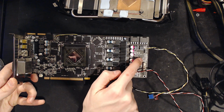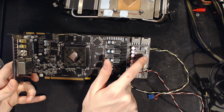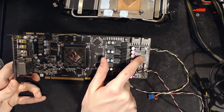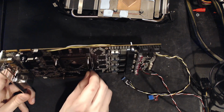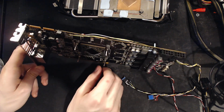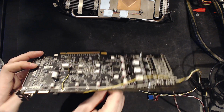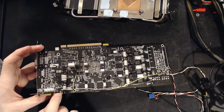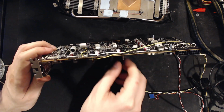They're not super high frequency, though. They go up to 1.2 mega, or 1.2? No, I think it might just be 1 megahertz. So yeah, these don't go to some super high switching frequency, but they do have the cool phase reassignment capabilities. But yeah, so ultimately I learned how to do the volt mods for these voltage controllers a lot less messily.